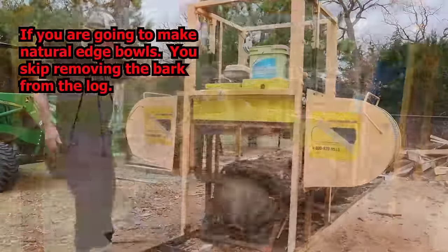So when I get through with this project, after I grade them and anchor seal them twice and grade them three times and then put them up on the shelf, I'm looking at less than 5 hours of time making 66 bow blanks. Not only 66 bow blanks, 66 bow blanks that are perfect, that we cut all around the imperfections, so almost every one of them can be picked up and used.